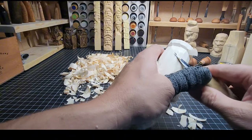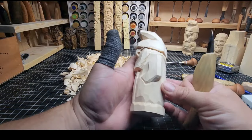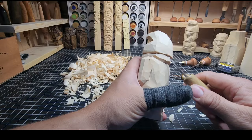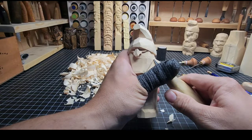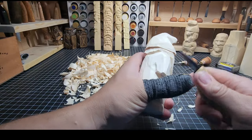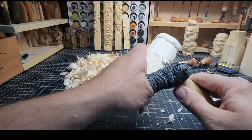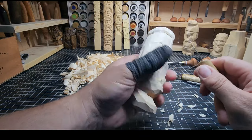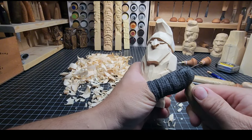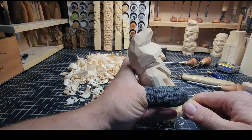There's no problem with fixing things as you go — that's what you should be learning and developing: looking at your carving with a critical eye, seeing where you can fix things, and determining for yourself what you're going to do. Carve off a little more on the back shoulder, round those edges off — I did one shoulder so I might as well do the other one. Want to be uniform and mostly symmetrical. We also want to do the insides of these elbows, but first we'll add little creases along the middle part of the elbows — a V-cut right here and right there. That makes the elbows really come to life.